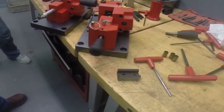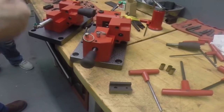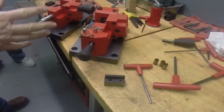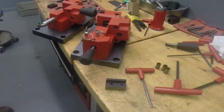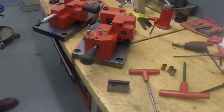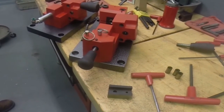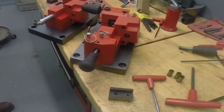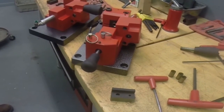So what do these machines do? Two things: one, they test the barrel for accuracy, and then they test the ammunition being fired through it. You can take different brands of ammunition and find out which ones shoot accurately through a particular barrel — some ammunition won't shoot accurately at all, and some will shoot better than others. So if a manufacturer is making their own ammo, say Sig or Beretta, they can actually tailor their ammunition to shoot in their barrels.